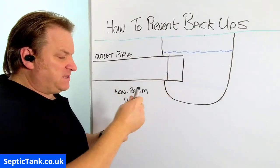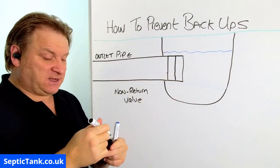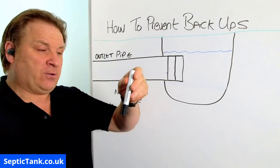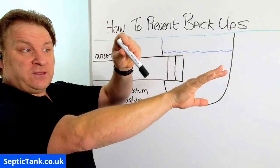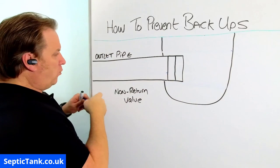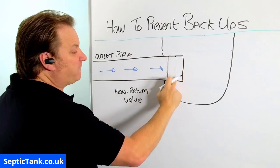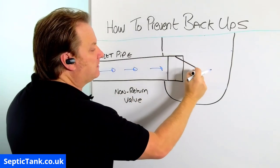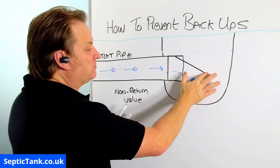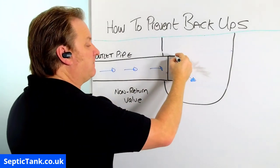Inside there's like a cap flap. If I just put it down in the center here — that's basically how it looks when it's at rest: the cap flap is down. With a normal cap flap, as water goes through the hole it pushes the cap flap open, and then when the water passes through, the flap shuts again. It's the same with this flap. Under normal conditions the water makes its way down through the outlet pipe, hits the cap flap, and that flap is pushed open, allowing the water into the ditch or stream.